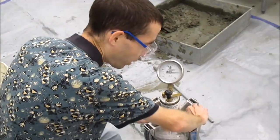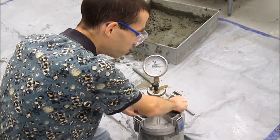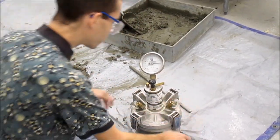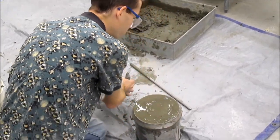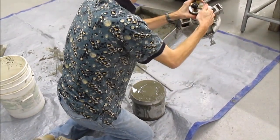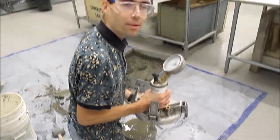When you're done, put your hand over the pet cocks while you open them — that's just a courtesy so you don't spray someone with water. Take the lid off — it's going to make a bit of a mess, but that's okay. Then you can discharge the air from the main meter. That's all there is to it.